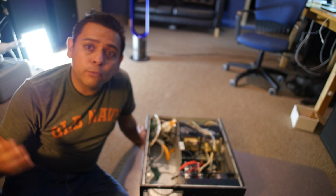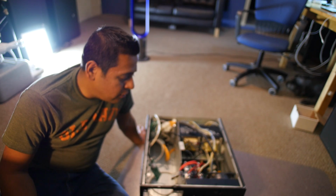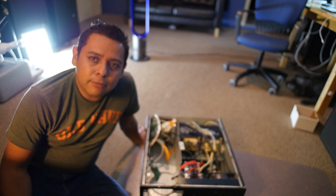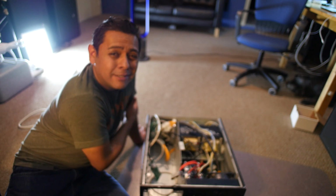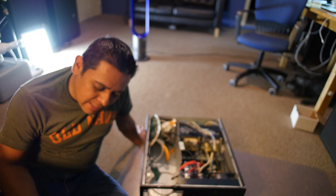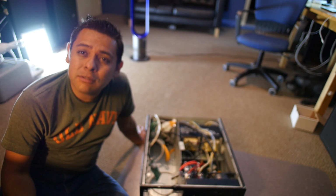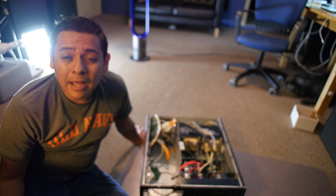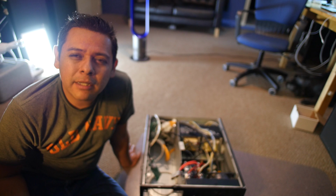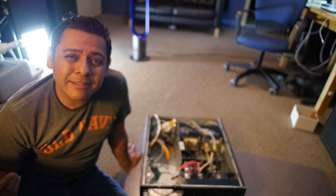It'll charge at 55 volts when the cells are 3.6, which is, you know, you're still leaving a lot of voltage there. So I might have to rewire the pack down to 13 cells. What's this? So 14, 3.92. So not even 4. So 14's too low. 13 is too high, it's like 4.23 or something. Maybe 14 cells, and it'll charge all the way to 4 volts each cell. Yeah, you're almost up there on the top. You're not leaving too much.